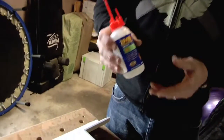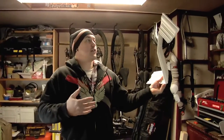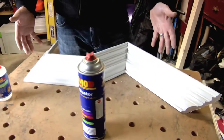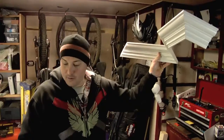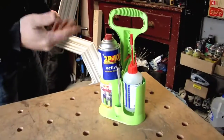When I first used it, I couldn't believe it. I sent an email off to Fastcap — I was like, holy crap, why did I wait so long to use this stuff? I couldn't believe how fast and how easy it was to use. You just got to get over that fear of assembling on the ground. Because once you start assembling on your bench and carrying it up, your miters will be so much tighter. There's no more nails. You can sand this stuff comfortably down here, not over your head. Bring it up in one piece, a couple of little pins, and you're good to go. It's crazy — it works well. I think everybody's going to love this stuff. Give it a try. Order it with the caddy — it's pretty cool. You can store everything in there, walk in the job, and you're ready to rock and roll.